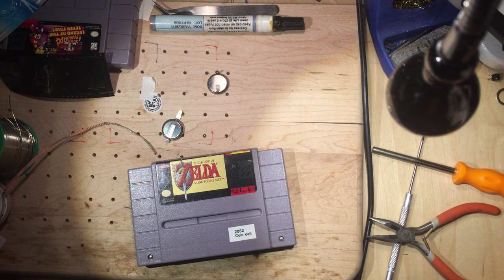And usually, start the console, let it go as far as it will go until you see that error message. And it won't let you pass that. So turn the console off again. And I think it took about three times. And during one of those times, it actually wrote what it needed to see onto the memory, and it was able to read it back the next time it booted. Again, that was a copy protection feature.